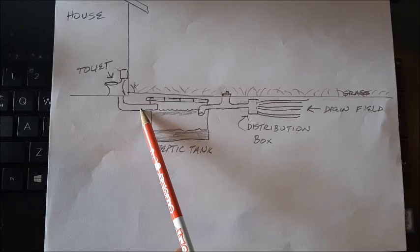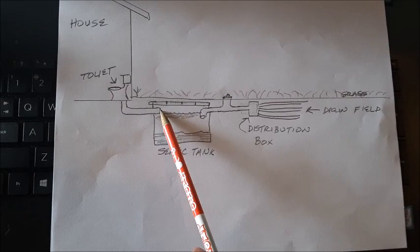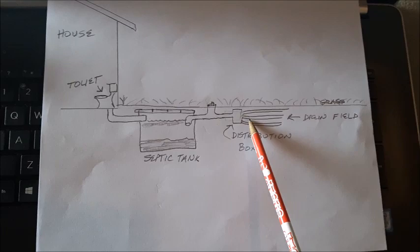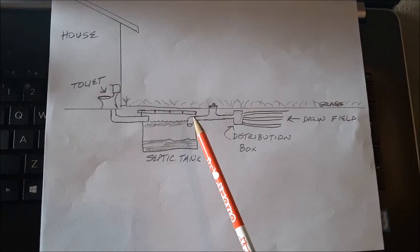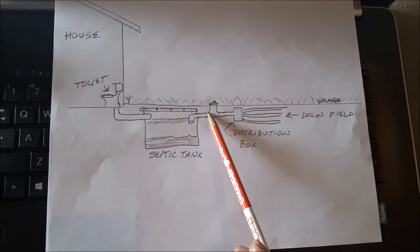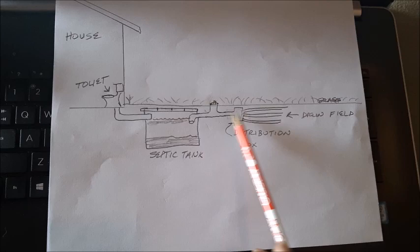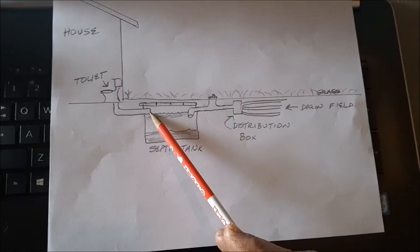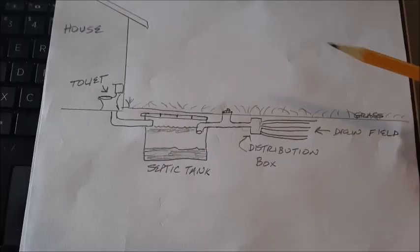To diagnose your issue: first, it's possible you can get clogs right where the fluid enters the septic tank. If the crusty stuff builds up enough, it'll block the entry pipe and back up all the way into your house. The second possibility is that your drain field has gotten so saturated with solids and roots that it's just running slow and nearing end of life. To diagnose, try to get access to see inside the septic tank, or dig up the pipe coming out and drill a small hole in the top. If fluid comes out of the top, your drain field is clogged. If no liquid comes out, you probably have a clog at the tank inlet, which a plumber with a jetter or snake could clear.